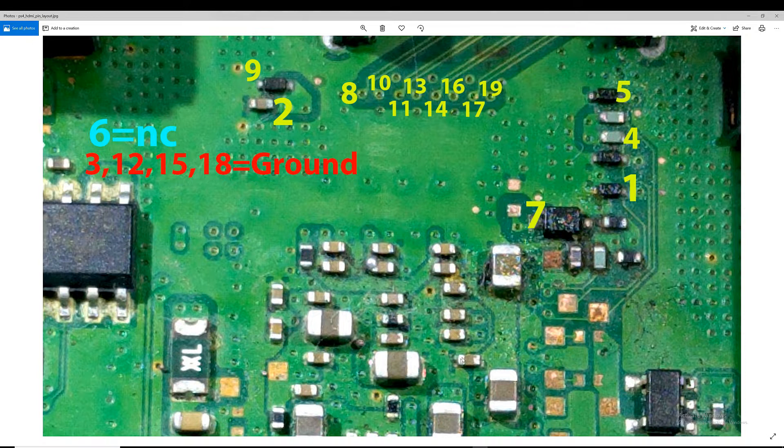I took a picture with my cell phone — not the greatest picture, but we can see a solder blob and possibly some flux that needs to be cleaned up. I did not notice any missing components, which is good. We can see that Cesar applied a lot of heat onto the board and some of the components look burned, but that doesn't mean they are not good — these components can take a lot of heat. We're going to run wires from the connector's missing pads onto those components so we can make this HDMI port work again. Let's take a look under the microscope to see what's going on.